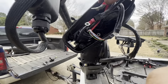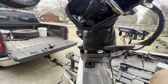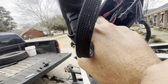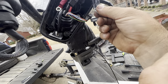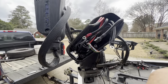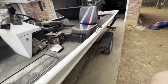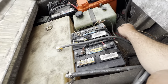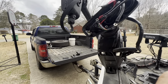The next part is you have to take off the two power connections. Be cognizant of which side is positive and which is negative. Positive is going to be on your upper side - the port side. Your starboard side will be your negative. Then unhook the data cable - be very careful with this because it is very sensitive. I always suggest going to the back and unhooking one of your cables there to disconnect the trolling motor. You definitely don't want 24 volts arcing up here.